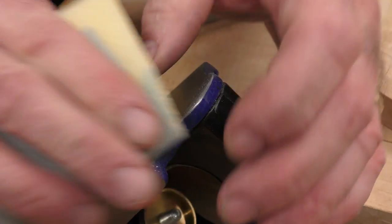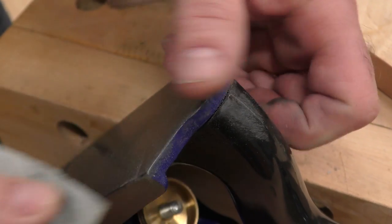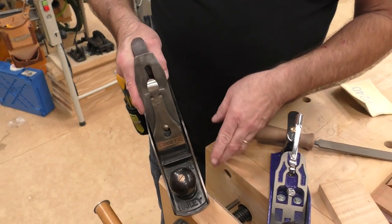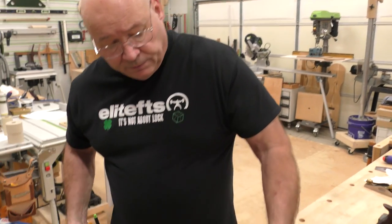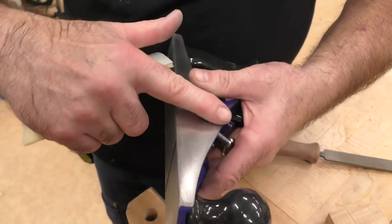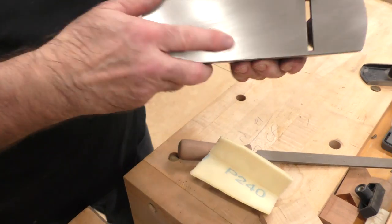Just a little 240 and it's becoming nice and smooth. We can do our final polish — I'm going to take this up a notch for Big D. That'll make it smooth; we won't have any plane tracks. For an older refurb, like this number 5 I just redid, I'd hone that edge with 240 to knock it off and create what's known as a slight chamfer. You want that hand plane really comfortable in your hand. No burrs — looks good.